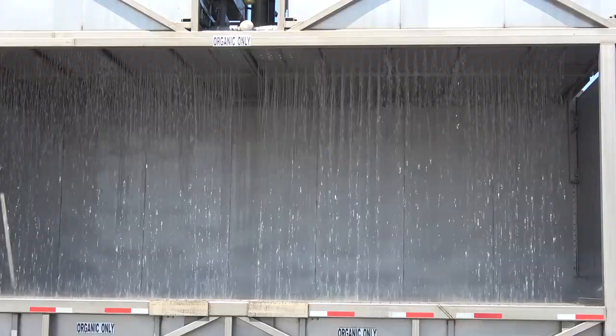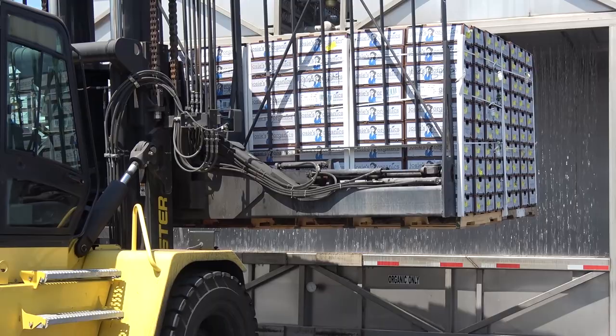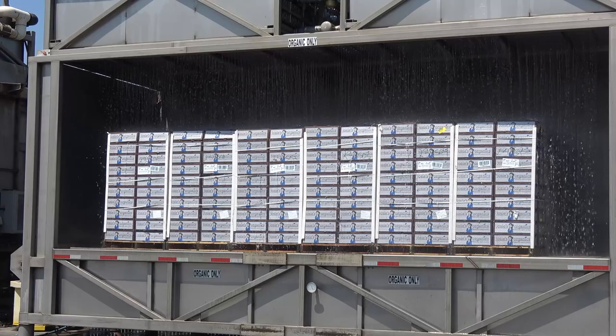Right now it's 40 degrees, and once it starts running it will begin cooling down. A 12-pallet forklift is used to load the hydro washer, also known as a hydro cooler, with product. The cold water enters openings in the top of the boxes, filtering down over the product and removing heat. Waxed fiberboard boxes must be used with a hydro cooler, as unwaxed boxes when wet would lose their structural strength and the pallets would collapse.